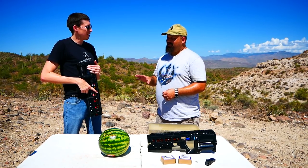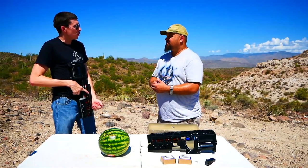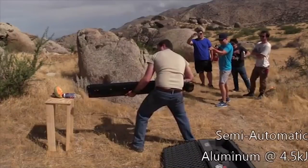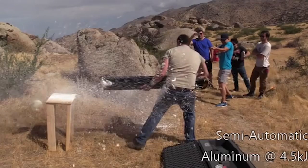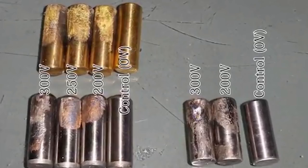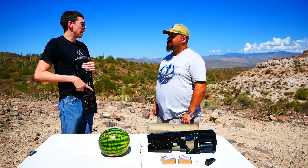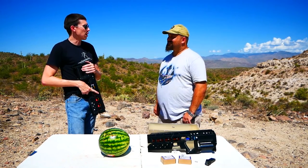You guys are working on a rail gun too, right? Tell me about it — what's the difference, how does a rail gun work? They're both similar in principle in that they use an electromagnetic pulse to accelerate the projectile. The coil gun uses a series of coils, whereas the rail gun uses two parallel rails. The current passes from one rail through the projectile down the other, and that creates the magnetic force. Rail guns are suited to higher velocities with smaller projectiles, which is more ideal for a firearm. Some of the challenges are that the rails tend to erode because of the high currents, the sliding contact, and the arcing. Because there's a ton of potential for that technology, we're doing a lot of R&D on rail guns — we actually have two of the world's only portable rail guns that we've designed and tested.